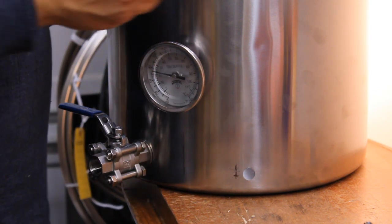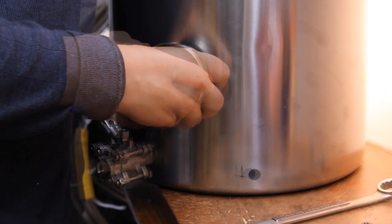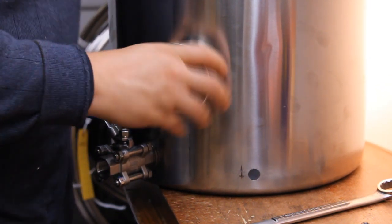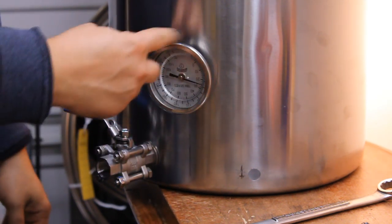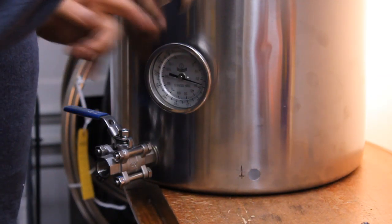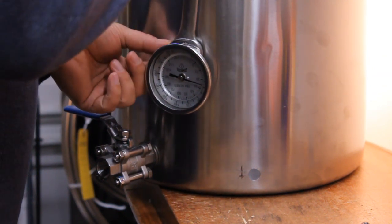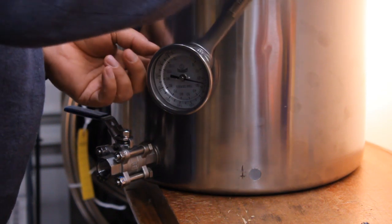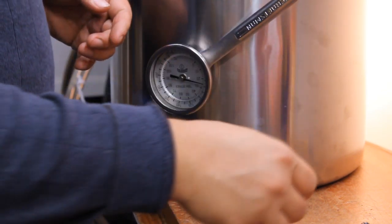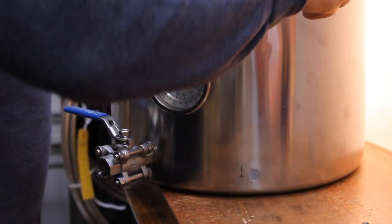Now we're just going to take our lock nut and screw it on. Okay, and as it starts getting really snug, you don't want to use the dial as leverage like a wrench anymore. There's a hex behind the face. It's 7/8. Now you could use a 7/8 wrench like this one, or you can use an adjustable wrench that's thin enough to fit behind here.